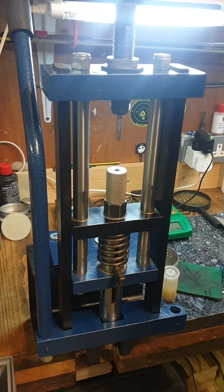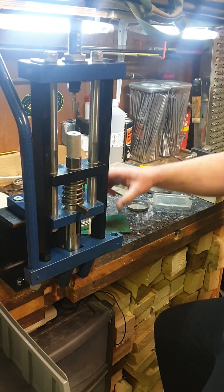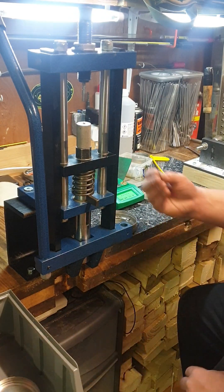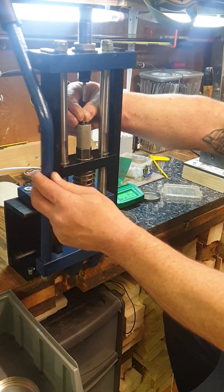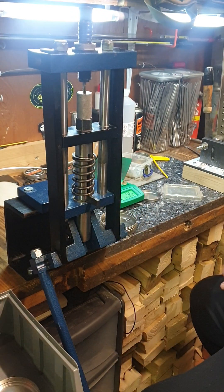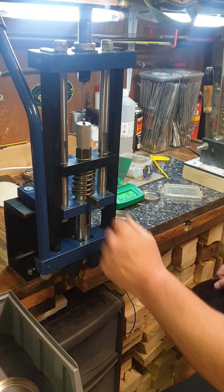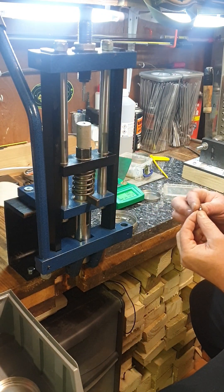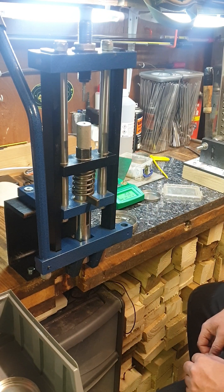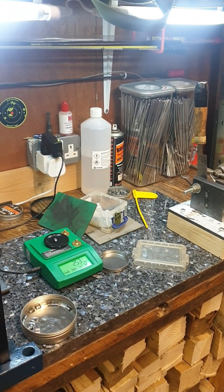Always take your core, put it on the press, and bring the press down. Now you'll see lead being forced out of this hole — that's called the sprue. At the moment we're hitting that with about 30,000 PSI of pressure, which then presents the slug. This one is a dish base, hollow point. And the weight is 25.3 grain.